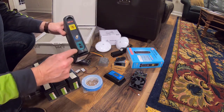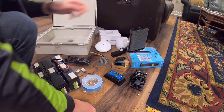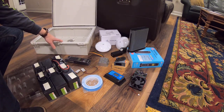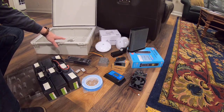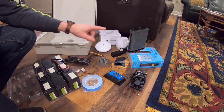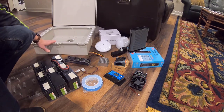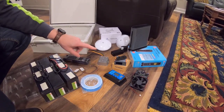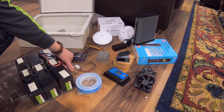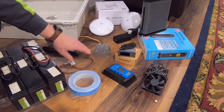The nice thing about this modem also is that it happens to be 12 volt. That's important because I wasn't sure if I was going to be able to get electricity to the box up by the road. I have to be under 100 feet from the road to get the internet cable to the modem. And to power the nanobeam and to power everything else that needs to be in the box, which includes the modem, but also will include fans for when it gets too hot, little heaters when it gets too cold. Again, they all have to be 12 volt.